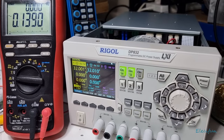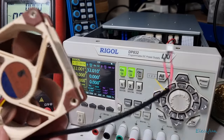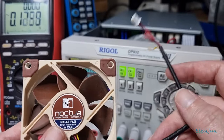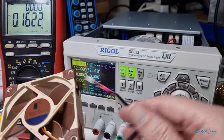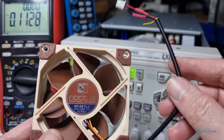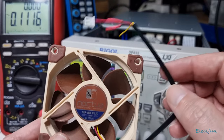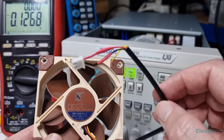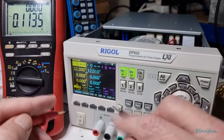Going off that last clip, I decided I'd put it back together. Everything seems okay. This connector goes on the newer board — the FLX type, it's only got three cables. The other one that's in here has four cables; it's the PWM type. This does not work in here — it comes up saying the fan isn't working, which is wrong, because this one works in the newer 2018 board and doesn't need a resistor. The fan inside this one needs a resistor across it to give it a larger load so it doesn't think the fan is missing. That's just something interesting when it comes to the different boards and the fans.